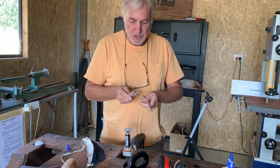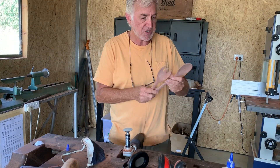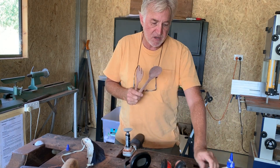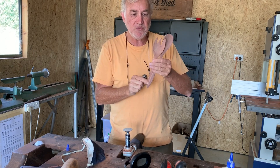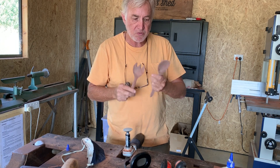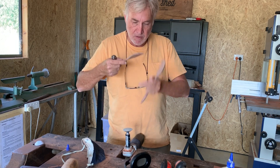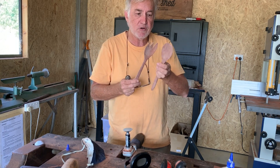In this video I didn't bother to show you how I made the spoons, but if you're interested I just cut them out on a bandsaw and then used the ball gouge to shape out the spoons. What I really wanted to show you is the way of using the contour sander to get into all of those different areas, and by mounting it in the vice I was able to manipulate the spoons very quickly and easily.